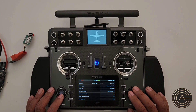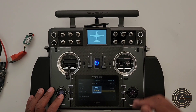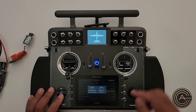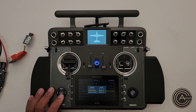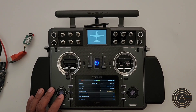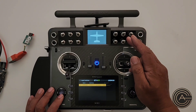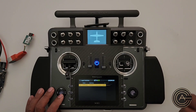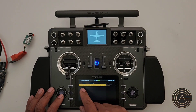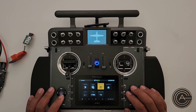When Consumption is greater than 4000 milliamps, turn on that switch. For the active condition I'll use this switch here — meaning that physical switch has to be up in order for the logical switch to be triggered. So if the warning gets annoying, I can flip that switch and it'll stop warning.